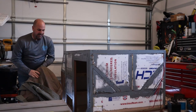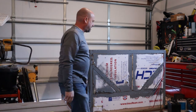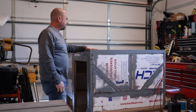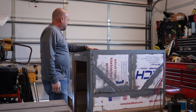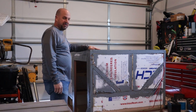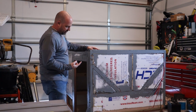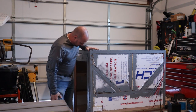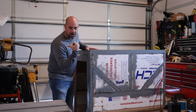This thing is really not that heavy. So I've got to move it. So this is the bottom. I just finished painting the bottom with epoxy. You saw a little bit of that. I put two really heavy coats of epoxy and it's been dried for about 24 hours now. I've got to flip it back over, primer the rest of the framing and the top so that tomorrow we can start the install of the paneling.